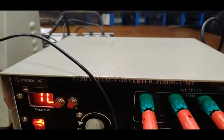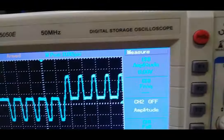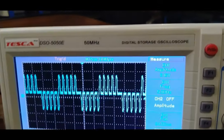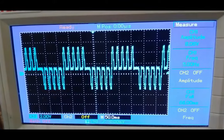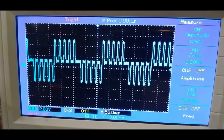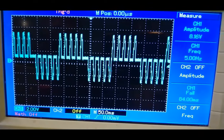Turning on the circuit, the output is approximately 5 Hz. Tuning the CRO slightly, we confirm approximately 5 Hz output frequency. This is how the cycloconverter converts frequency. This experiment uses the R-load; we can also use the L-load.